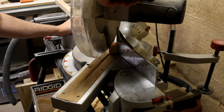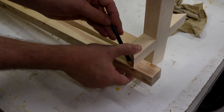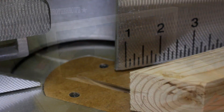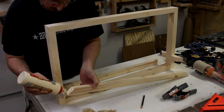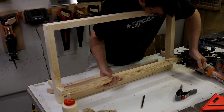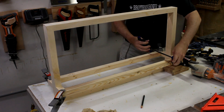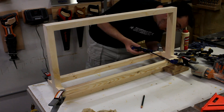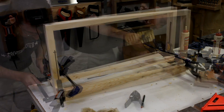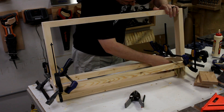The next step was to cut the miters for the side rails. Since there may have been small variations, I just held up each rail and marked exactly where it needed to be cut. Now gluing this up was a nightmare. I started by putting some glue on each end and then using spring clamps to just hold it in place until I got the other one ready. With both held in place by spring clamps, I used squeeze clamps to pull them in and tighten the joints. Then I replaced the spring clamps with something stronger to keep the joints from shifting, and then I just added a bunch more clamps because I'm paranoid.